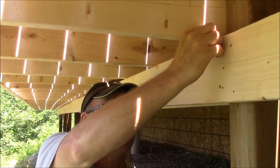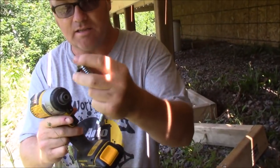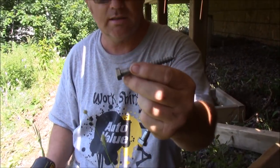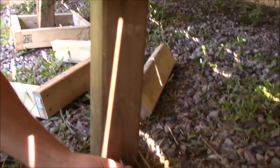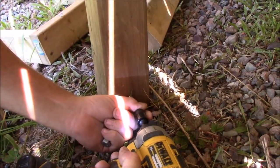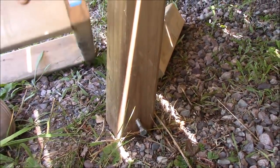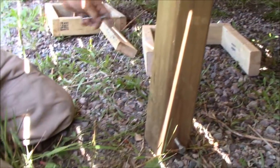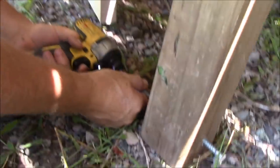I'll set this up here for now. That's the bit to put my screws in. This was sent to me, which I really appreciate — that kit that was sent to me. I'll show you how I do this — I just take a couple of these lag bolts. Once I'm done, the whole pad will have to lift and it should go back down. I'd leave it sticking out that far. That's the size of the forms I built, just really quick. I reuse these too as I go. I try to stick these about halfway up or a little lower than halfway of the forms — I just stick two of them in, one on either side, just so it grips the concrete.